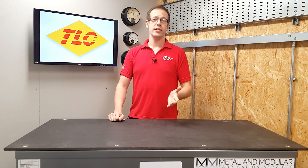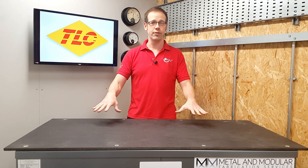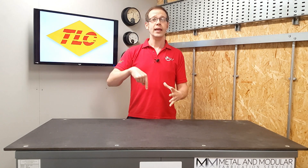That's where our other term comes in: the soil-embedded ring earth electrode. This is an earth electrode laid flat in the ground, encircling the building, so it forms a big ring. This acts as the earth rod again, and because it's so long, covers a large area, and forms a ring, it will give a low resistance connection to earth.